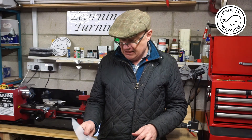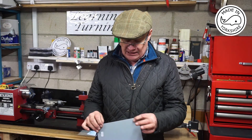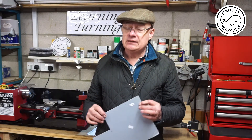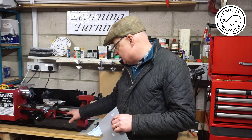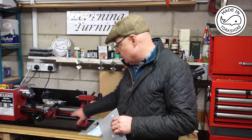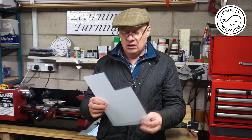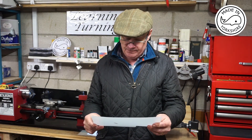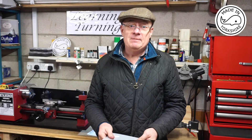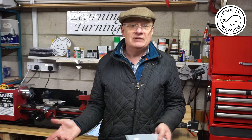I would highly recommend this polycarbonate sheet — they call it Lexan — it's only half a millimetre thick, but it works great with the SC3 lathe. You are really restricted by having the cover over the lead screw, but this really did the job; it's flexible but strong as well, so once screwed in place it's the business. Anyway, I'd like to thank everybody for the help, support, and advice — it's very much appreciated. If you like my videos, please subscribe. See you later.